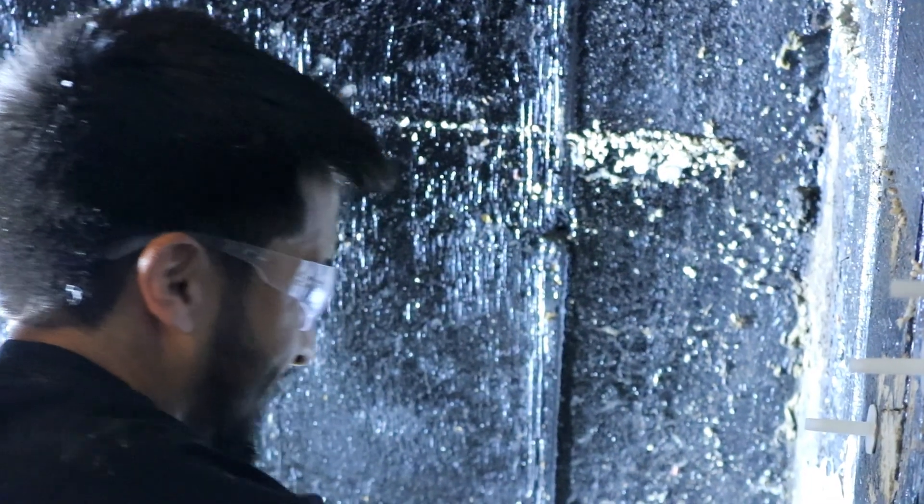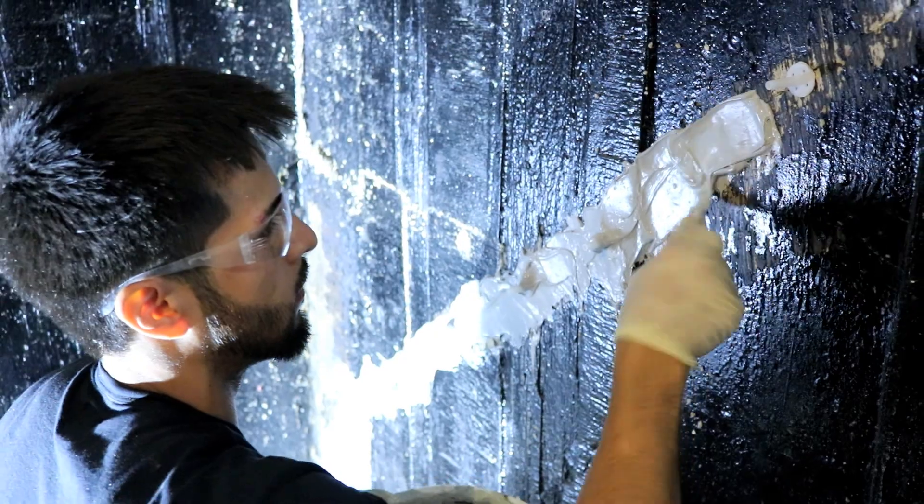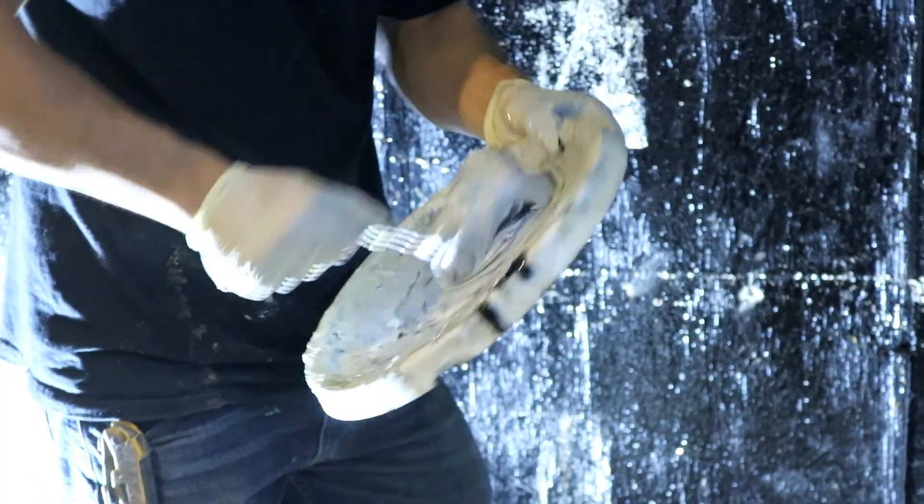So how do you fix that? We're essentially just going to inject epoxy into that void. So what's up with all the goo? That is our epoxy paste. We're now building an epoxy barrier so that when we inject our epoxy, it stays in there while it cures.